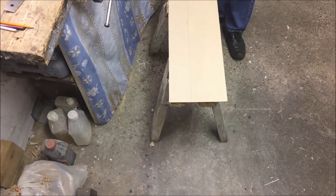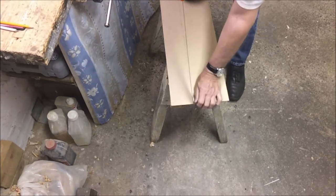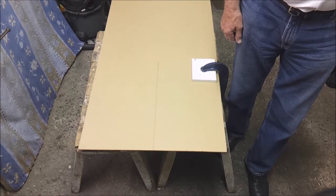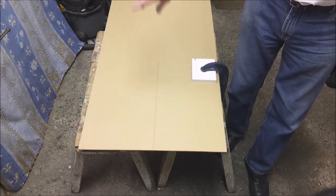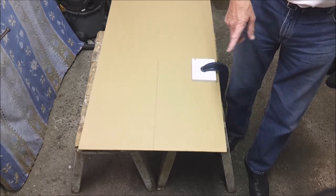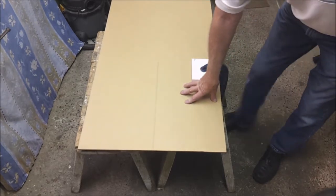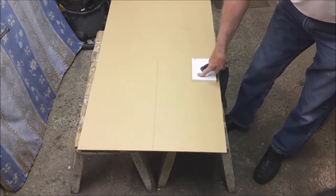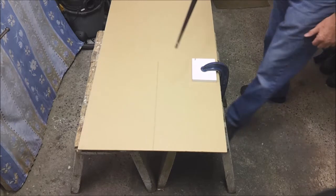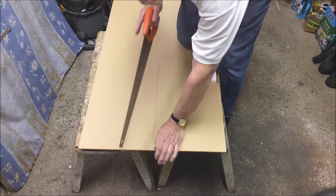Now I want to talk about cutting boards. If it's a relatively thin board, keep your hand very near the cut line and that'll stop it vibrating. This is an example of how we set about cutting a large board — this board is two foot by four foot, it could just as easily be four foot by eight foot, and we need it firmly supported. So I've got it on two saw stools, I've got it clamped, and in case this is a very special furniture-finish board I've got a piece of protective material to stop the clamp marking it. We can lean across and kneel on it so that we can get our nose directly over the saw to make sure we cut in a straight line.